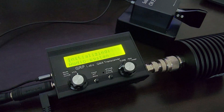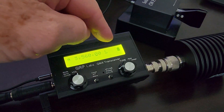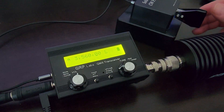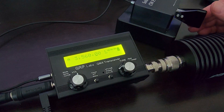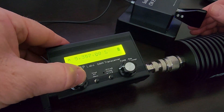You'll see it here. I've gone through the menu settings and changed the side tone volume and pitch back to close to where they were. I've turned on AGC, turned on the RF power meter reading, and the battery icon, just like it was before. So let's start out on 80 and see how it sounds. Again, this is with the audio thump suppression not yet enabled — and as you can see already, 80 meters sounds better even before we enable that feature.